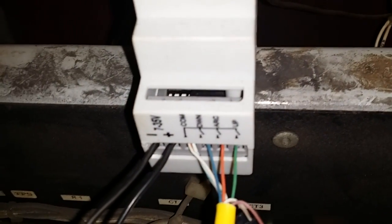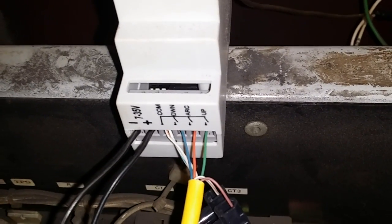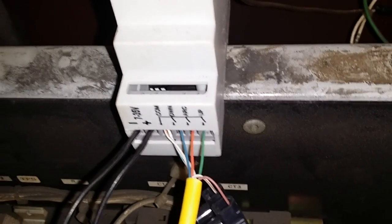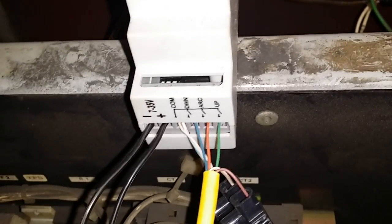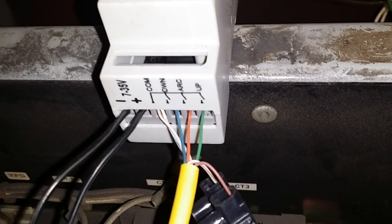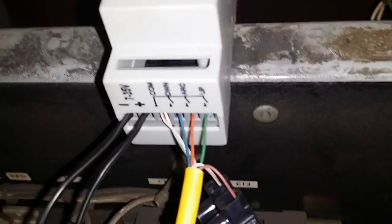These are connected here. As you can see, the COM is a common wire which is connected to the minus on the breakout board, on the computer, on the electronics for the CNC control. The red, green and blue wires are signals: up, down, and arc-ok.